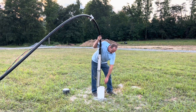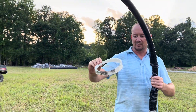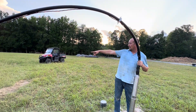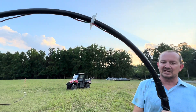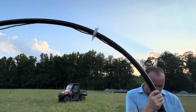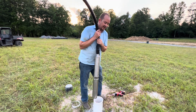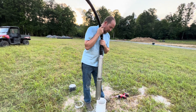We're here at the wellhead. We had to trim the top — it was a little jagged for the well seal, so we cut it nice and straight. We're getting ready to drop the well pump in. The wires have been installed along the entire drop string and you can see the wire guards in place — they keep the pump off the well casing itself and protect the wire from getting gouged. As we drop the pump down, there are tools that bolt to the side of the casing with two roller wheels to help if you're by yourself, so you don't nick the wire on the casing.